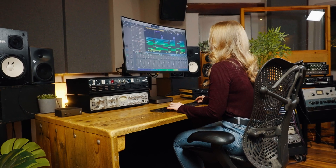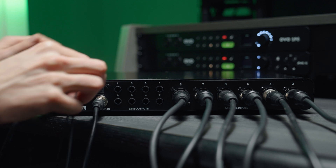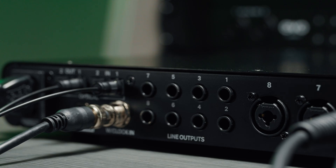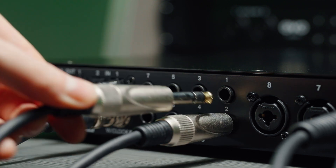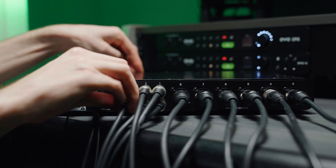All of the inputs can be sent to your existing audio interface using one or both of the optical outputs on the rear panel, either via ADAT or optical SPDIF. When using digital audio, you need to ensure that all of your devices are in sync with each other. With SP8, you have the option of clocking via the ADAT outputs, making your audio interface synced to SP8's clock, or for a more streamlined workflow, you can use the word clock input or even the ADAT inputs to sync from your audio interface's internal clock. SP8 also features eight analog line outputs. By default, these will send out a copy of your inputs — perfect for backup recordings on an external recorder or for sending audio to a mixer. You're also able to switch these analog line outputs to digital mode, enabling you to send audio from your DAW out of the line outputs, so you can use SP8 to send audio to outboard gear while mixing, or feed headphone amplifiers while recording, without using up the line outputs on your audio interface.